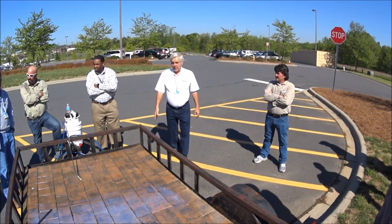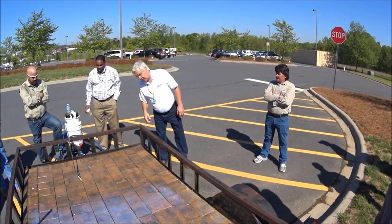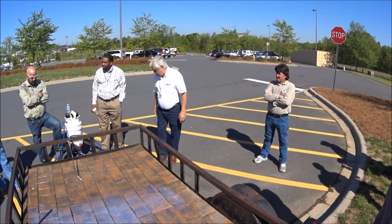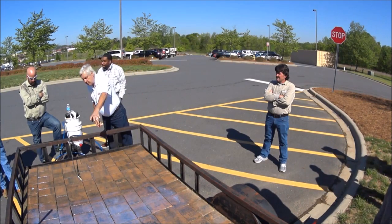Yeah. You don't have to broom every time you spray. This new sealer is really laying out really nice. It's really only if you're getting, like he talked about, the different elevations in the paver, right, because you don't want the sealer to puddle in those.